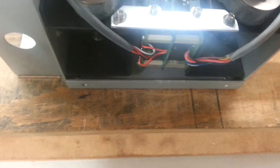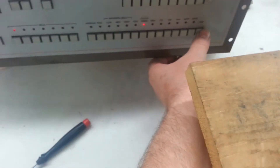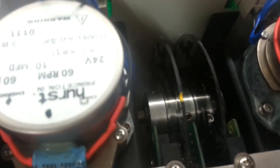Now the sensor wheel is no longer at noon, but the hour is, so we don't need to worry about bumping the hour hand because it's correct. We're going to come over here and press stop one time, press the low bell button, set two times, and now our hands are rotating. There is a yellow mark — I placed that there because it's hard to see — that's actually the 12 o'clock position in reference to this block. The hour hand is correct. The minute hand wheel, when it comes around, will line up with that same mark. The hour hand is not moving because it's already at noon.